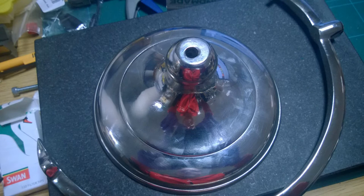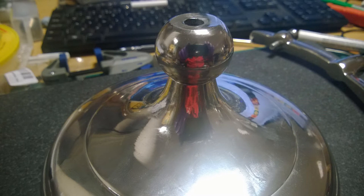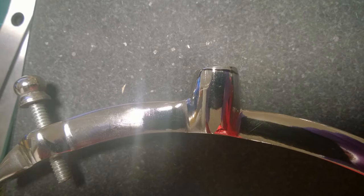The next things to cover are the other challenges: the globe bracket, the base, and this little round off-center weird bulb nodule thing — which was rubbish so I completely got rid of it. One problem I noticed is that this casting of base metal, this really cheap chrome-plated metal, didn't sit level — the globe was on the piss basically, and everything didn't sit nicely.